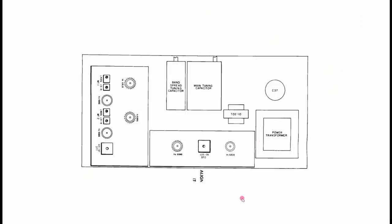Let's look at the general layout. They've done a beautiful job — it's actually a lesson in 1950s receiver best practices. Notice how the most sensitive stages in the front end are located completely kitty-corner to the power components. This is a really smart layout — keep your power supply away from your RF front end. Also notice this is where all the heat is going to be generated, and your converter tube right here is pretty far away, which is going to help with your tuning stability and drift.